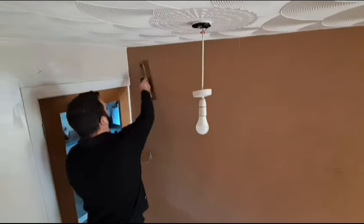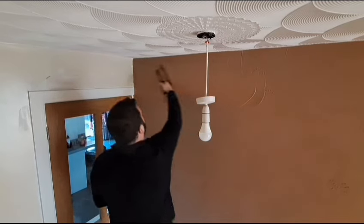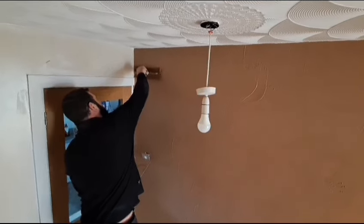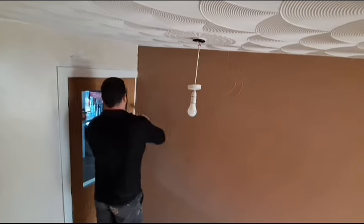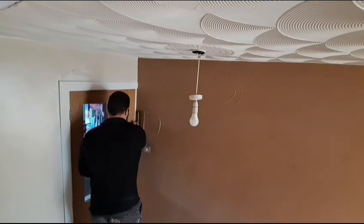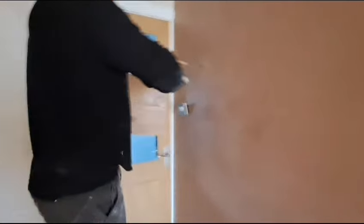Here we go — same as before, but I'm going to speed this up a little bit. We're doing exactly the same as the first coat: starting from the top left, working to the top right, then the bottom left and the bottom right. Now we're just putting on a nice second coat, and this is what we're going to work with to smooth out. The first coat is mainly just to get the wall flat, filling out hollows and imperfections. The second coat is what we're going to smooth off. Each consecutive trowel — first, second, and third — they're all exactly the same process over and over again until it's finished, just without applying more plaster.